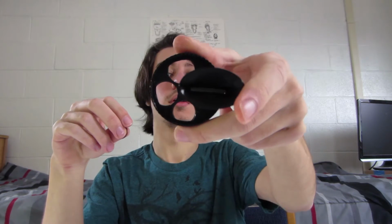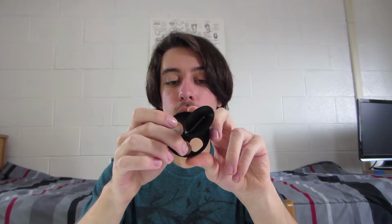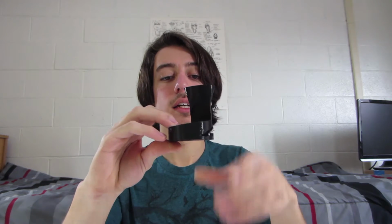It currently functions by having a funnel at the top. It has the 4 holes for each size coin, and what's supposed to happen is that the coin falls down the funnel, moves along the edge until it gets to the right size hole, and then falls down into place, and then there'll be an extrusion underneath allowing for storage of all the coins.